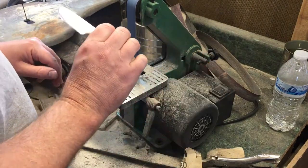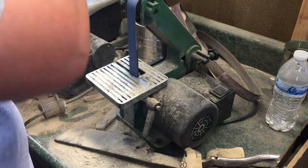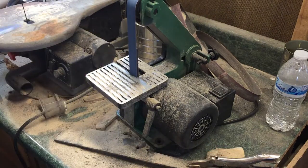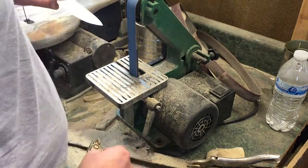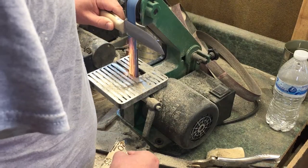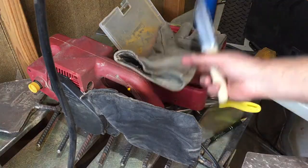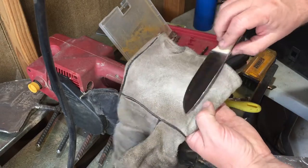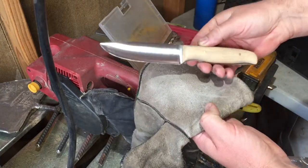Here I'm cleaning up the plunge line — or the bevel edge. I had a terrible time getting that straight, and that's a combination of inexperience on my part and the fact that I was crafting this from a lawnmower blade. I had done a lot of work with the anvil and hammer trying to get things flat, but it just never quite got perfectly flat, so there was always a little waviness and distortion to the bevel line. I had a pretty good flat bevel going, but I decided to make essentially a convex profile for the rest of the blade. I think it turned out pretty well. I'm not looking to put a mirror polish or a beautiful 600-grit satin on it — for now I was satisfied with that. I want this to be a functional knife, but it was also a test bed for learning the trade.